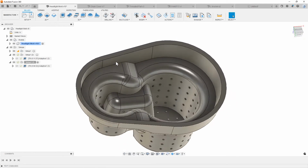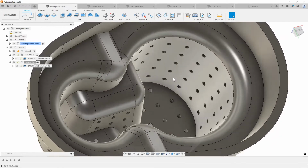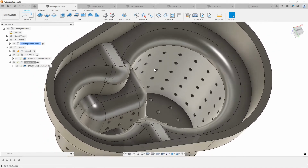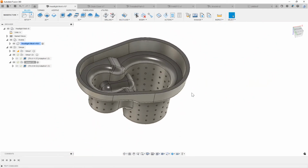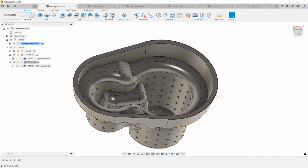In the back, this is just a cavity. And what we typically do is we just rough this out, leaving no stock, because again, it doesn't matter. It's going to get bolted onto a mold plate, and everything on the inside is just cleared out for venting purposes and to make sure that the steam goes through, right? So for things like this, I don't need to tie up my full 5-axis UMC machine just to go ahead and rough all this out.